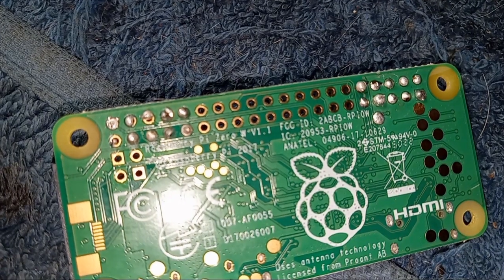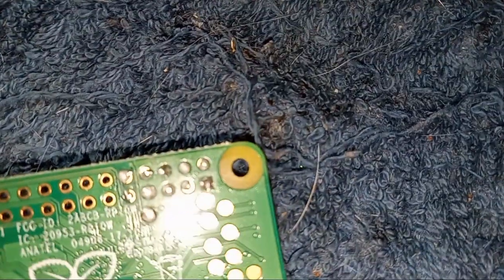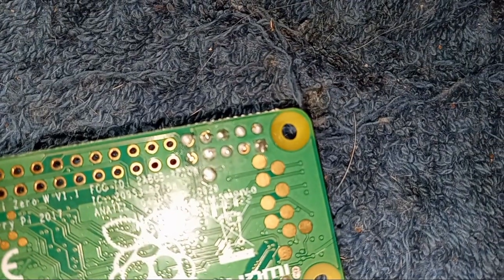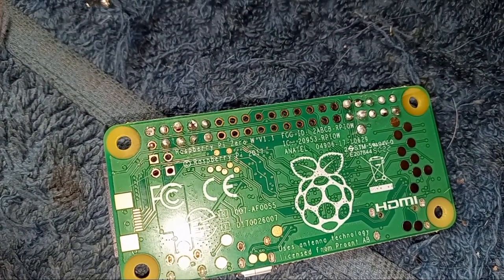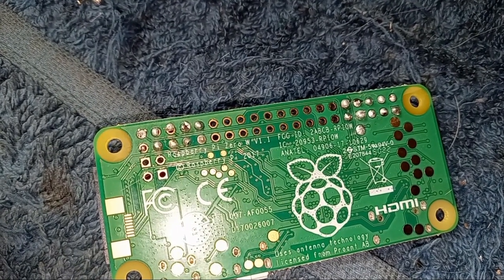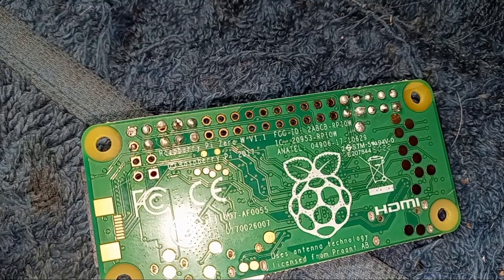Okay, so I've got one, two, maybe three I need to reheat on the left side. Right side looks like one or two I have to retouch. The problem is the solder is too thick — I need thinner solder. We got a nice fine tip point but the solder is too thick. That's all I can find locally; I thought I had some finer stuff but who knows what I did with it.